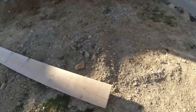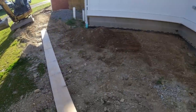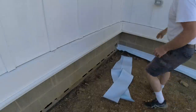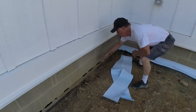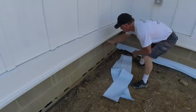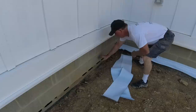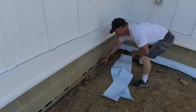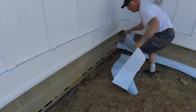We're going to do a porch here — rolled slate, broken stone face — one or two more steps down to a walk. As you can see, this is a block foundation, no termite block here for whatever reason. They're going to put stone out here on this ledge, no brick, so they probably should have used termite block here and waterproofed over it.